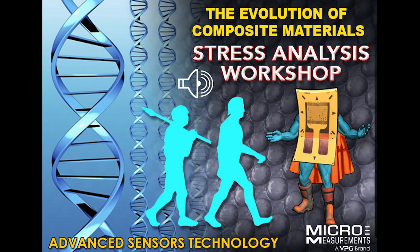The important thing about this class, whether you're a beginner or advanced person in composite testing, is that we cover the tension, compression, and shear modes of testing — the three primary modes for composite materials. We also use different types of gauges: uniaxial, T-rosettes, and three-element rosettes. We actually perform the tests and show what it does. Composite materials are different than most materials, with a variety of properties depending on fiber type and orientation. This is probably one of the few classes, if not the only class, that combines composites, strain gauging, and the application part of it.